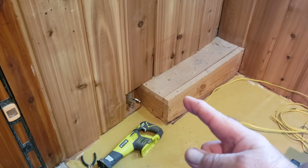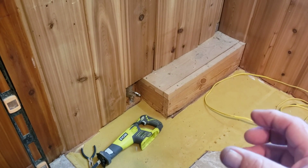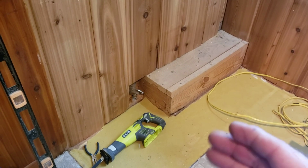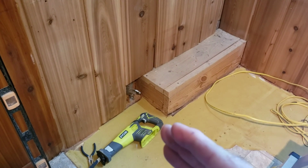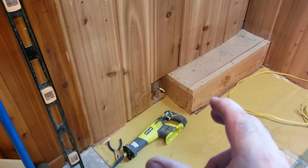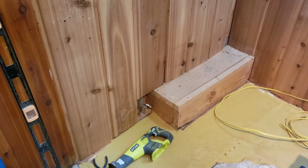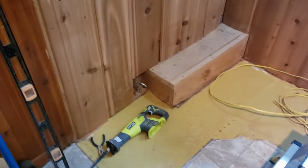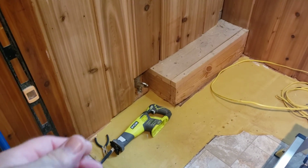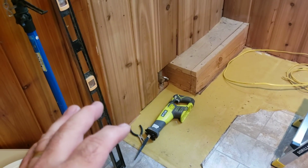Because this space is actually about 2.5 inches into that cabinet box, we're going to cut and notch the bottom of the cabinet box around that space. And then we're actually going to take the side of the drawer box and reduce it by 3 inches. So this box of this base drawer 30 3-drawer, the bottom box is going to need to be replaced with a 27. That way the drawer box is actually the right size to fit that space. We're going to go ahead and cut it down, but that's what we're going to do to begin with as far as putting that in.